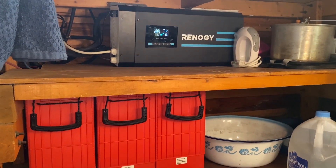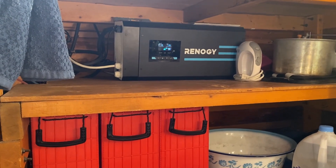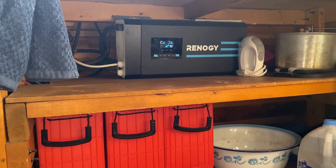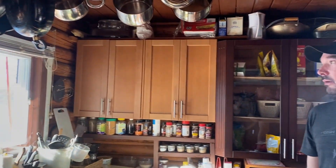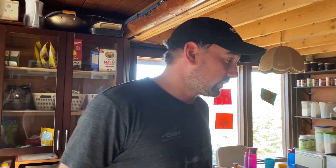The generator can charge these batteries from close to 12 volts in about two hours. The inverter shuts off at night, but the fridge stays on at 12-volt and we still have lights and can charge things without the inverter. The fridge does draw almost a constant 80 watts, so it puts a damper on the system. With light and sun every day, no problem — plenty of power. On a gloomy day you might need a bump-up in the evening depending on your draw — TV, Starlink, etc.